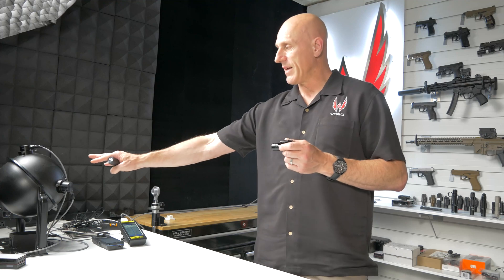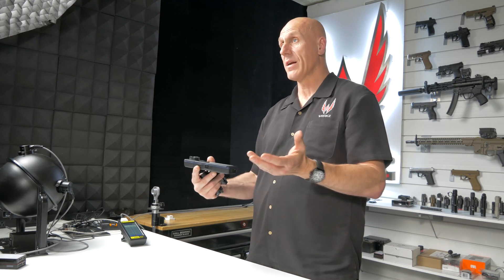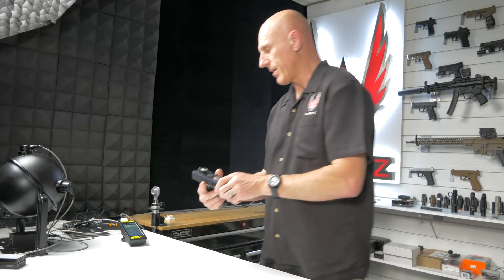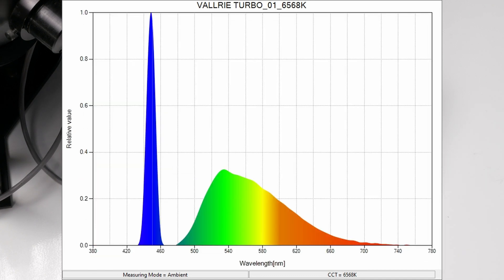We did test it. It does have about 250 lumens — we tested it in the integrating sphere, and the results were about what I expected. We also tested it with our meter: color temperature is about 6,500K, and it has a not-so-spectacular CRI of 61.9. Not great. We tend to see high 60s to low 70s out of LED lights, so the CRI is significantly lower here. Again, you're probably looking for a long-distance light if you're looking at this one.